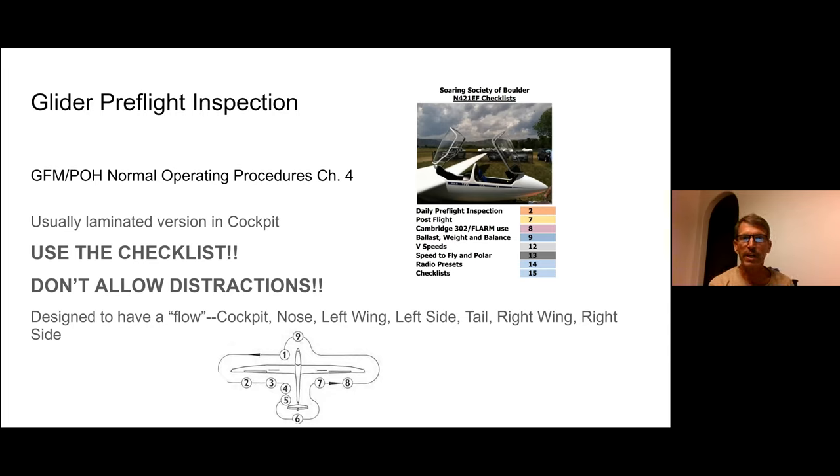And that's obviously easy to have happen in the mountains here. So if you have an oxygen system failure, you're probably not going to be going cross country. You're going to just be flying low. But just as maybe more important is your personal limits. Most people I know have it set with the system. It has 5,000 foot increments to come on no later than 10,000 feet that it starts giving you a demand. And I use that just kind of as my limit: if I'm above 10,000 feet, I want to have oxygen. So if the system's failed, I'm probably just flying around very locally.